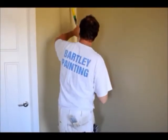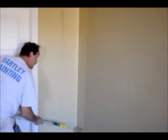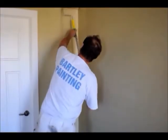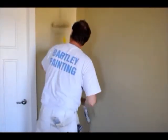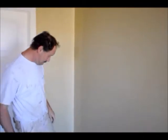Ray Bartley, painter extraordinaire, is using the three-quarter inch microfiber sleeve. With the bevel on the sleeve, the fabric extends over the edge and allows you to cross-roll into the corner. When you back-roll off the other swirl mark and you're done cutting, you don't have to go bare with a brush.